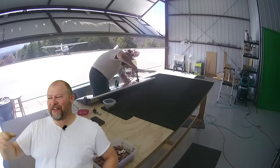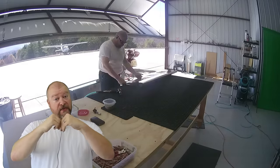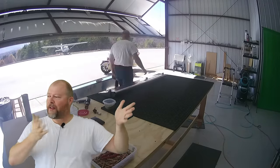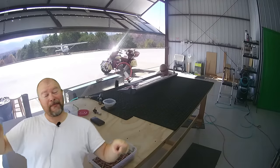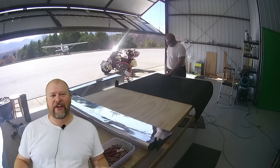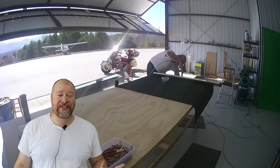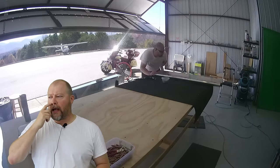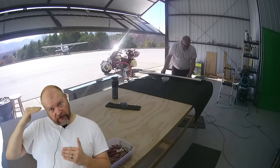Halfway through I started to realize exactly what was going on. I was working from the center of the leading edge outward, and I started to notice that the center was ever so slightly lower. That's because either side of the aileron was higher because there was a bow in my table. I moved everything to the end, finished it out, got it all straight, and I think the aileron came out beautifully — no twist in it. The leading edge is a little wavy, and I think that's because of having to go back and fix that bow from the table problem.